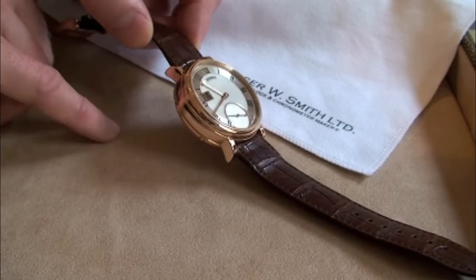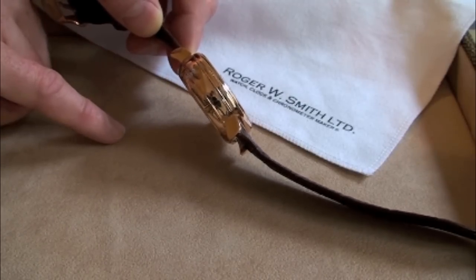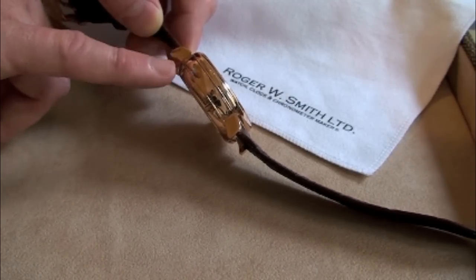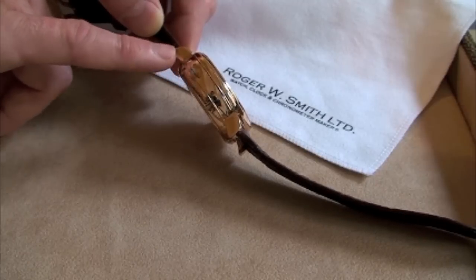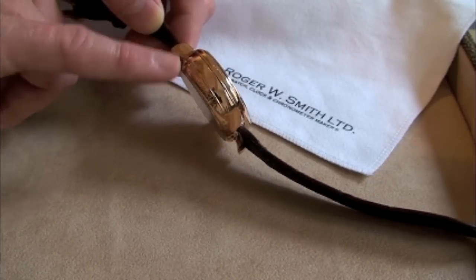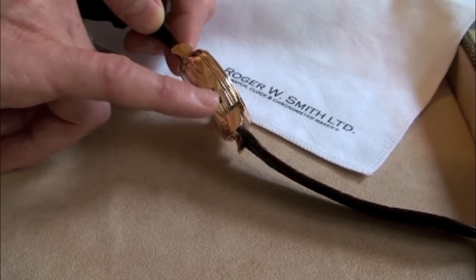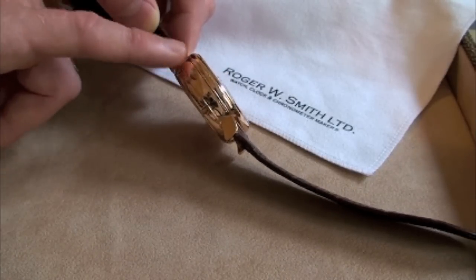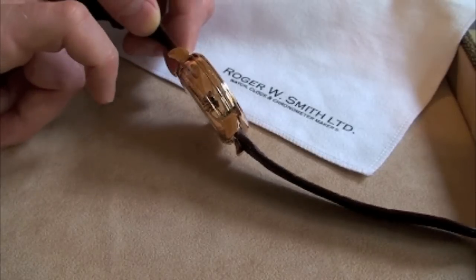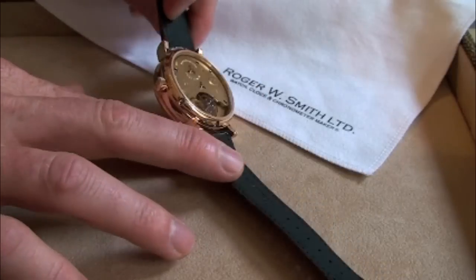The case has been hand fabricated. The case took two weeks to make and was fabricated out of three strips of gold, which I bent each individual strip into a circle, soldered, and then drove into a tapered former. Then I put this curve on simply by mounting it in a lathe and turning the excess metal away. So it is a very hands-on approach to watchmaking.